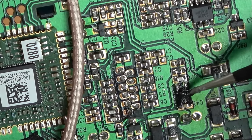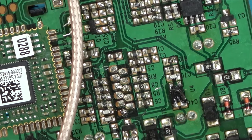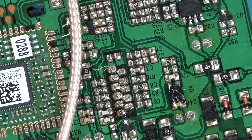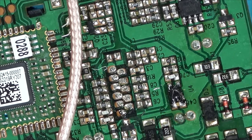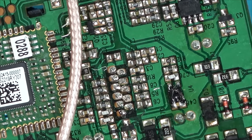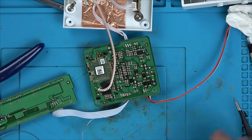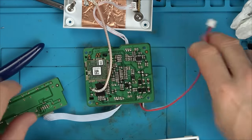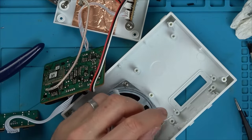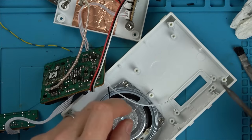I've run a wire between two pins on the chip because there was a track originally going between these two pins but it was burnt off. Rather than running the wire on the track I've done a slightly ugly arch on top and covered it with liquid tape to stop any chance of it bending or touching other pins. Whether it's an arch or a track, it does the same job — it connects two parts of the chip together via the board.